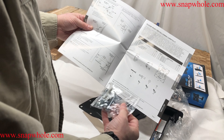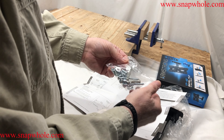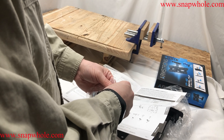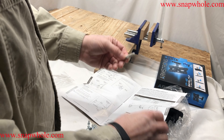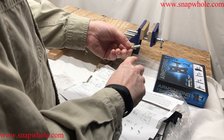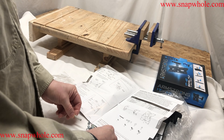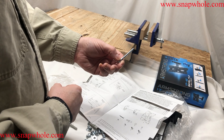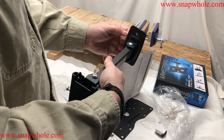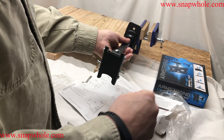The exploded view diagram shows they do give you wall sockets. If you're mounting in drywall, I recommend you not use those — those inserts in drywall with something heavier like this probably aren't going to work. I've never had good luck with those. They do give you these for mounting into a stud, so what you should do is put this on the wall in front of a stud and drive two of these in.